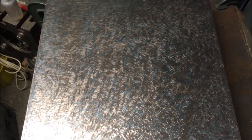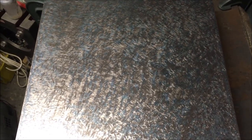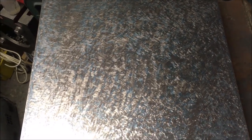I'm quite happy that I can achieve an ever decreasing curl. I mean, as an example, these are sort of a quarter of an inch tip to tip, but you can see, there's no point in me developing that area until I get rid of that blank stripe, and the same over here. But I just got to keep working down the blues and it will get there. But it is going to be boring as hell videoing it, so I'm not going to bother. I'll finish this off in my own time, and hopefully in the next video we'll see some progress with Chris scraping the straight edge.